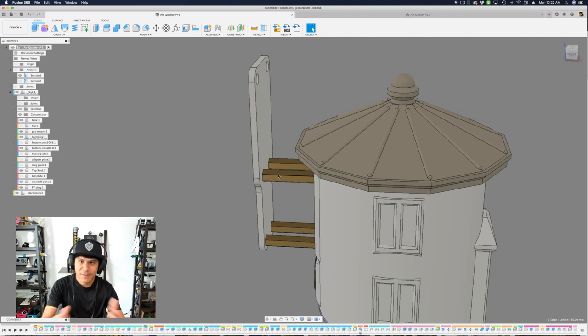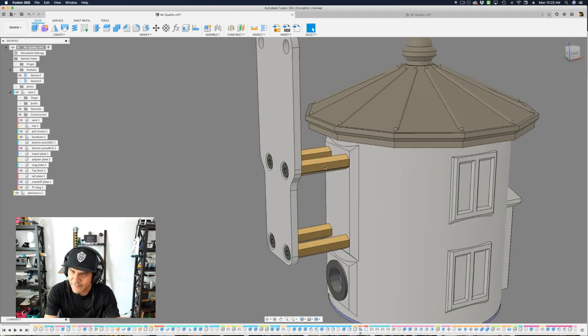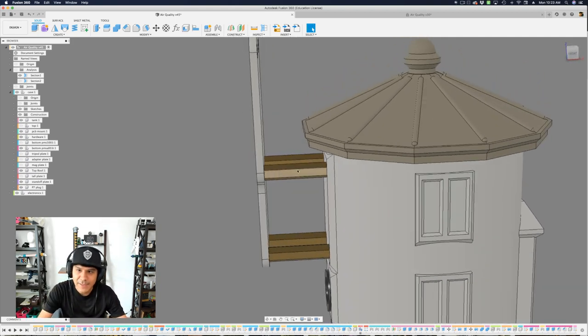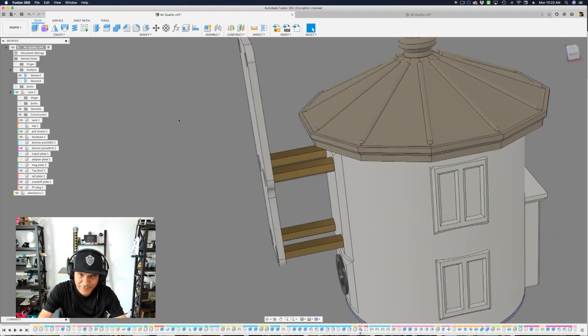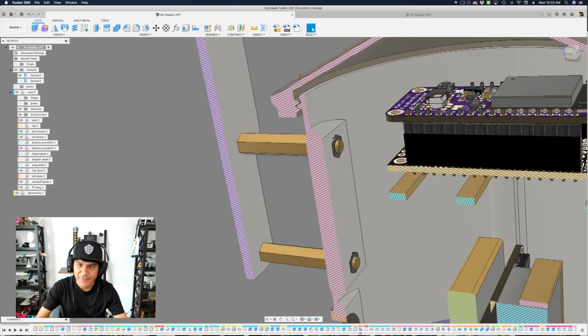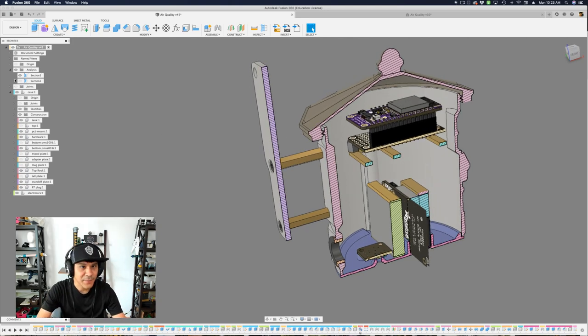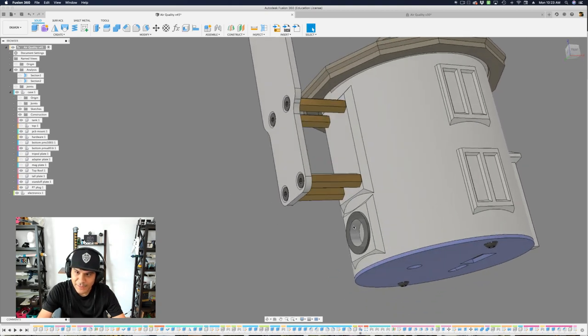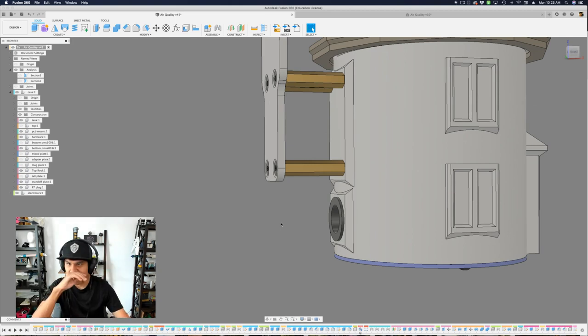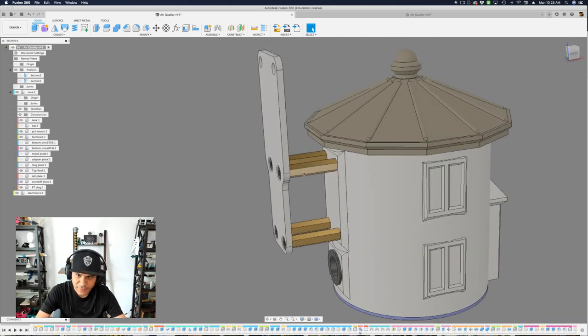These are 26-millimeter tall standoffs, available in all sorts of different sizes. This made things so much better because you don't have to 3D print the standoff, which reduces print time, and it's a metal standoff so it's really strong and won't break. The style is a male-to-female end, MF style. It's easy to press-fit the hex nuts into their spots and fasten the standoff into those capped hex nuts. That makes assembly a lot easier and more rigid and strong. You can also play around with different lengths depending on where you're mounting and how much clearance you need, since the cable gland is fairly tall and you want offset from the mounting surface.